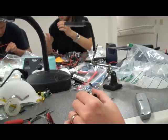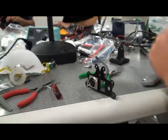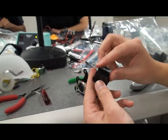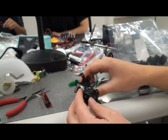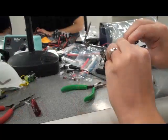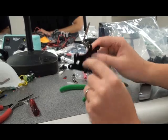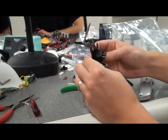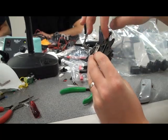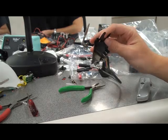Now we have to get the power switch in there, and the power switches are here. We opted for these guys, and any power switch will do. We only need 2 pins, and we will connect them like this. And then before we actually start installing it, we have to apply a little bit of hot glue goop here and here, because when this stuff starts bending against the speaker, the actual switch will tend to expose itself, which we don't like.